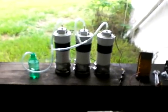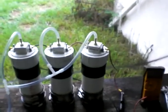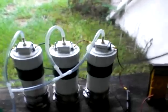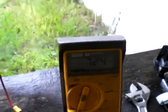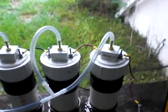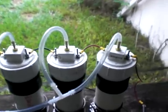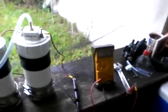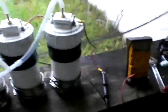What we have here is a screw cell multiplied times three. I've got three sets of screw cells, all wired in series, so I've got a total of about 13 volts applied end to end. The entire arrangement is drawing 7.24 amps across the entire three cells. Each cell is dropping about four and a half, almost five volts — it's going to be one third of 12.5, just over four volts per cell — and we're drawing 7 amps through it.